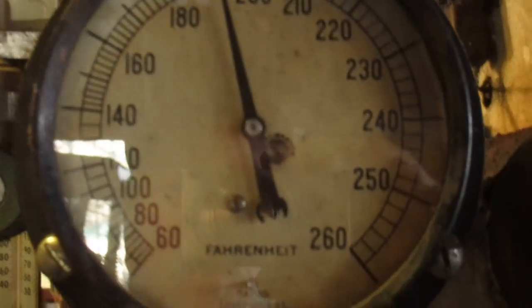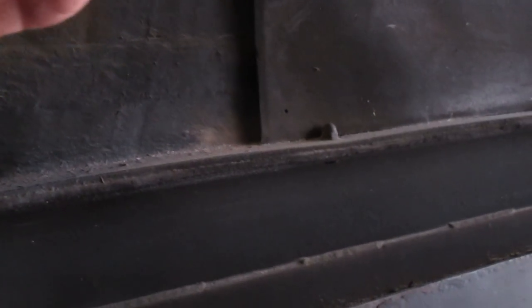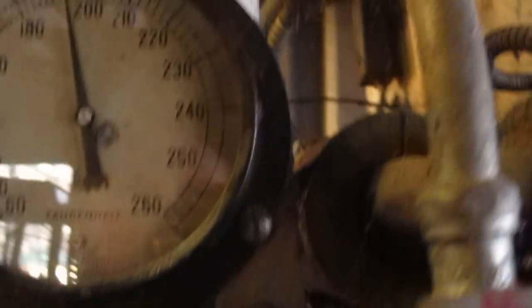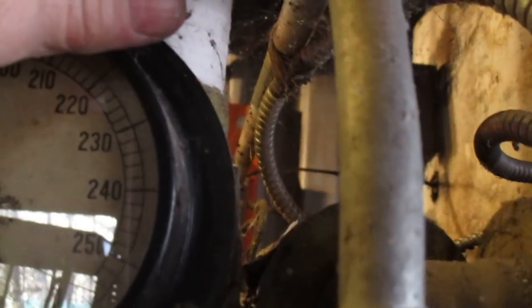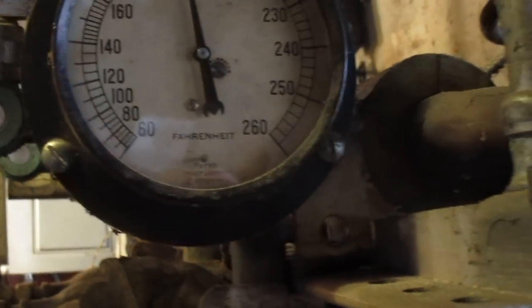Now it's going to start coming back down. We're up to 192 — that's going to probably keep going up because there's such a big bed of coals down there. The new gasification boilers trap all that up in the top part of the boiler, but 25 years ago when we made this thing that just wasn't the way it was. It has to go up to 204 before the dump zone comes on, and right now it would just dump heat into the greenhouse.